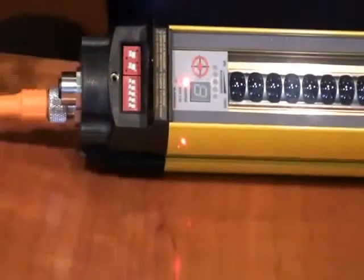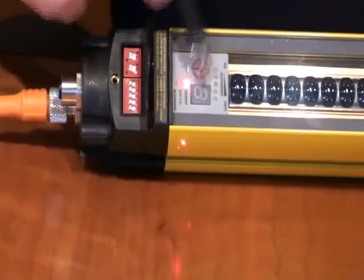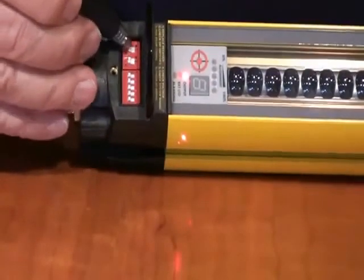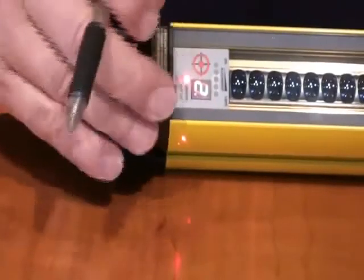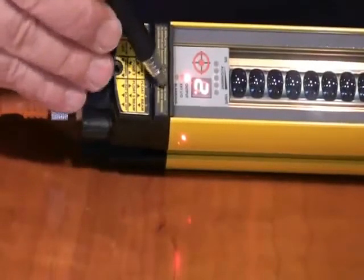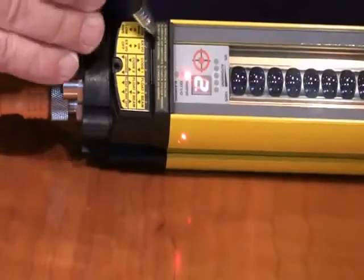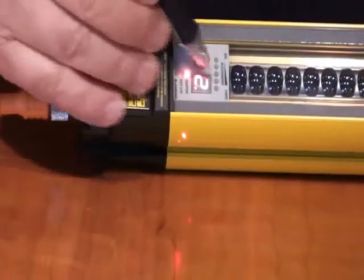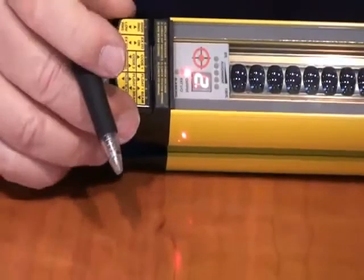Another nice feature of this product is that it has a troubleshooting diagnostic — a seven-segment display. I can illustrate how that works by making a change to a dip switch. You'll see immediately it comes on and you can look up a diagnostic code. Those diagnostic codes are listed right here and they'll show you in detail what these numbers represent — not just what they say, but they'll give you a correction. It says there's a dip switch change; what happens is we need to un-power and power up the unit again, and then that error would be clear.